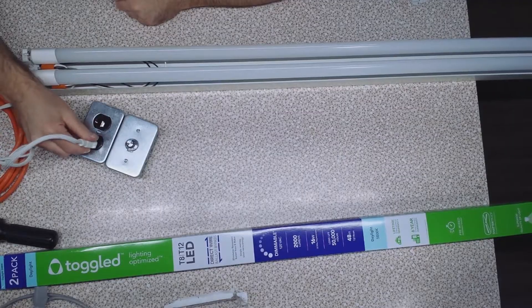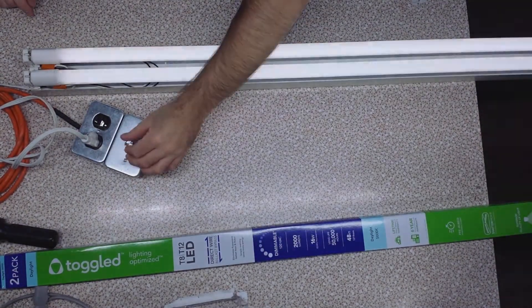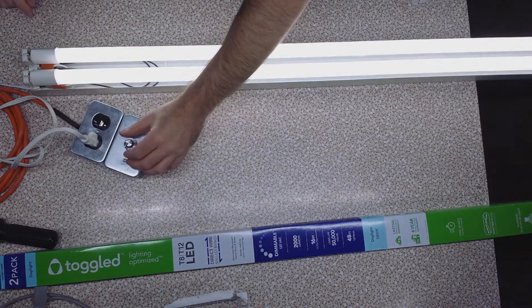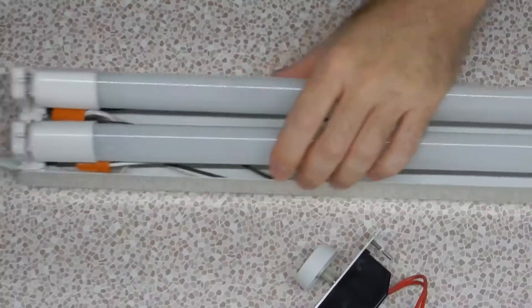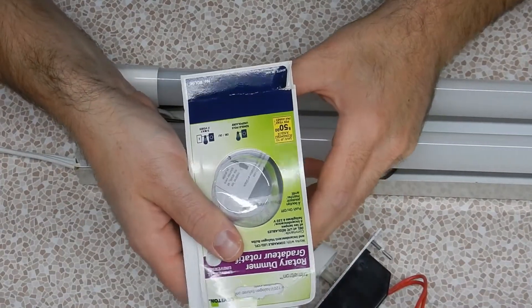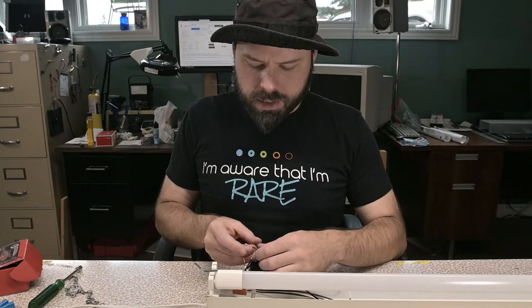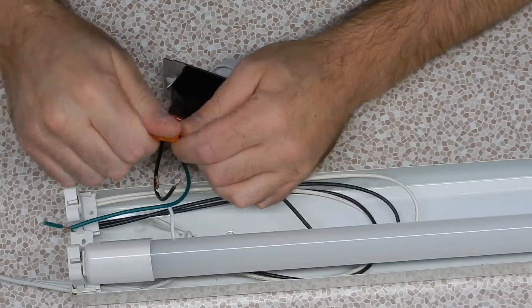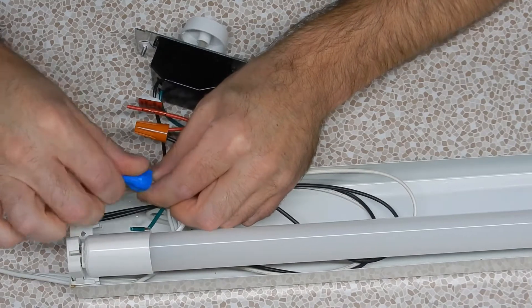I'm going to take this to the next level because I have it under good authority that these are dimmable. I'm a little sketched with this dimmer — this is an old dimmer not necessarily rated for LED lights. Looks like it wants to work though. I need to proof-of-concept this, so I went to the universal tire corner store and got this universal rotary dimmer. I'm going to disconnect the hot — this is output from the dimmer right here. Then, to the hot, I'm going to connect the input for the dimmer.